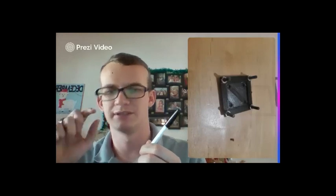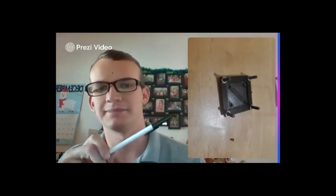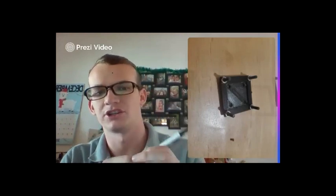That way it will leave room so that you can actually get your board into the base plate. You'll need that little bit of extra space, as well as your flight controller will sit inside of that recess. So make sure that recess is on the same side as those hex washers you're putting in. And you're going to put the four bolts in along with a washer on each one and just cinch them up tight